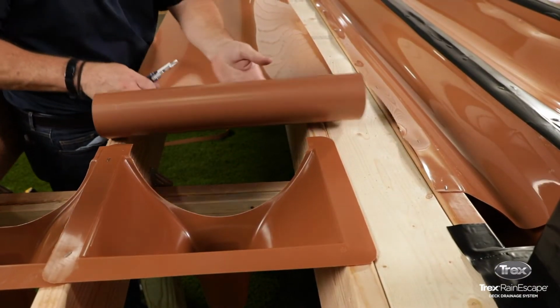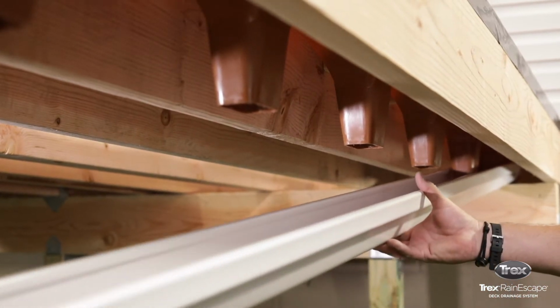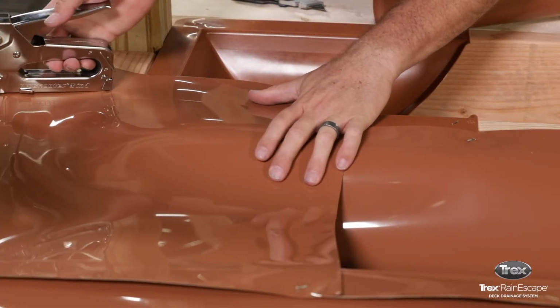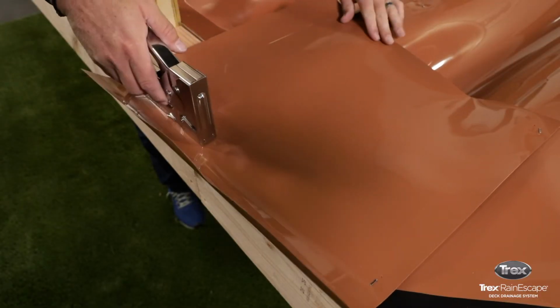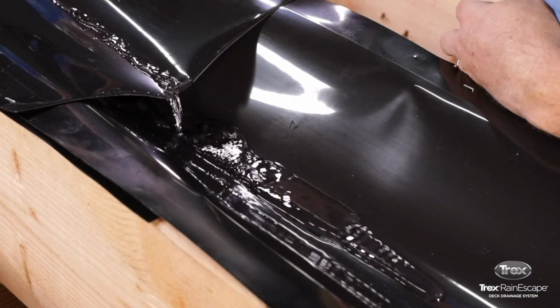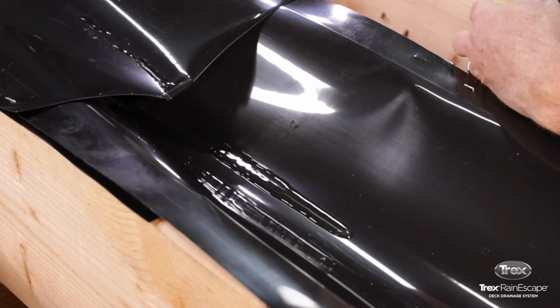If you're cantilevering the bays, install the downspouts in a straight line so the gutter below the deck will be straight as well. At each bay opening, run a cantilever trough back into each of the downspouts so it drains into the existing trough, following the trough installation instructions.